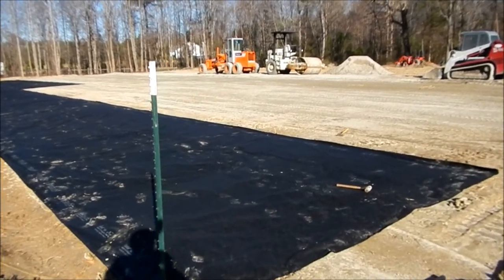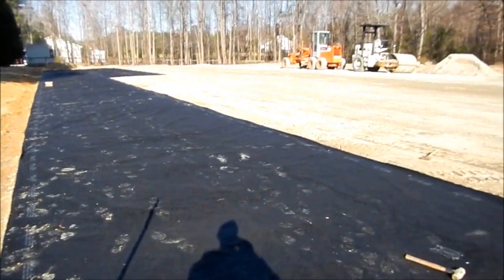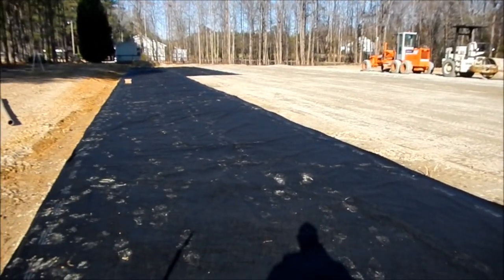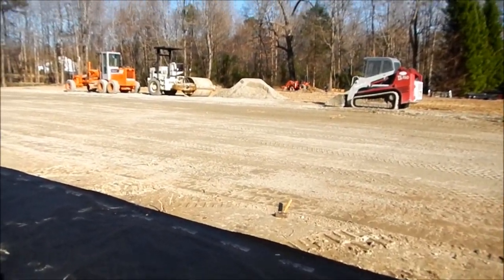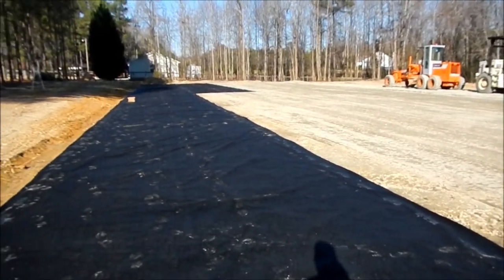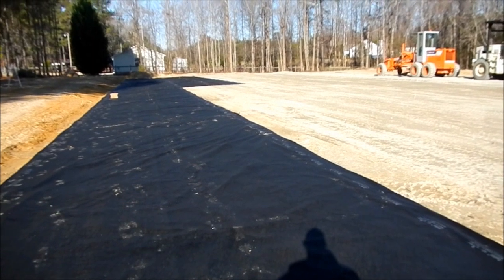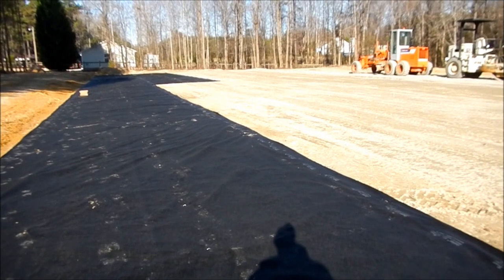Here we are day three on the horse arena. We're about ready to put out the fabric. We got half of it graded out nice; the other half is still kind of rough graded. We had about a two inch rain, and this is the cut side so the ground was nice and hard here, but over there it's a little bit soft, so I got that broke up with the bucket teeth letting it air dry. Doesn't really dry much when it's 30 degrees and the wind's blowing. We got 24,000 square foot of fabric to put down — a little over half an acre.